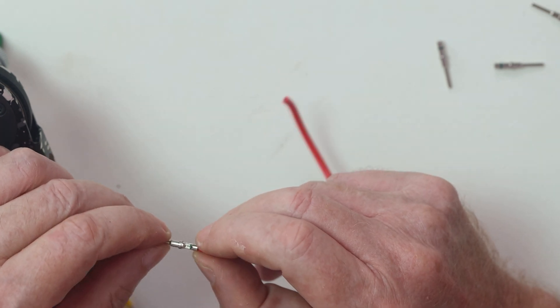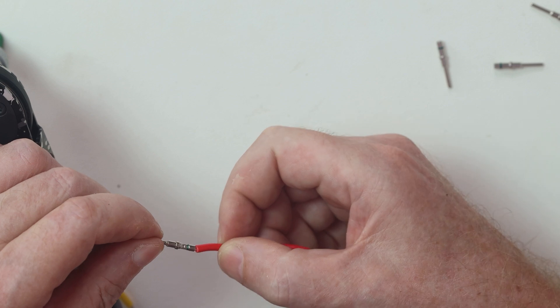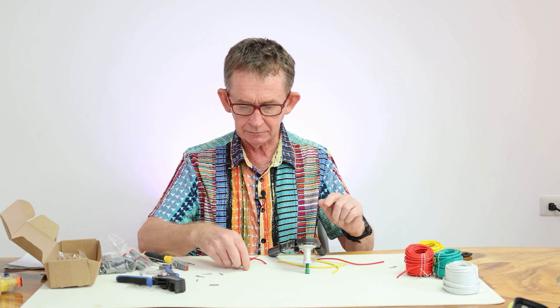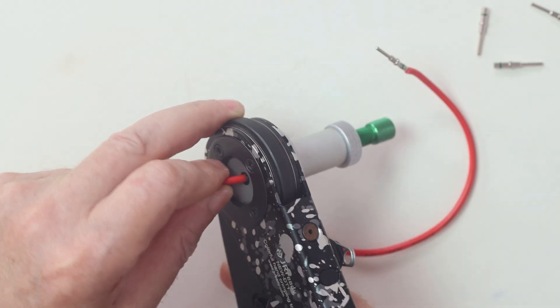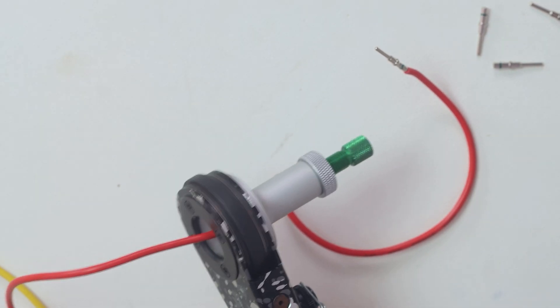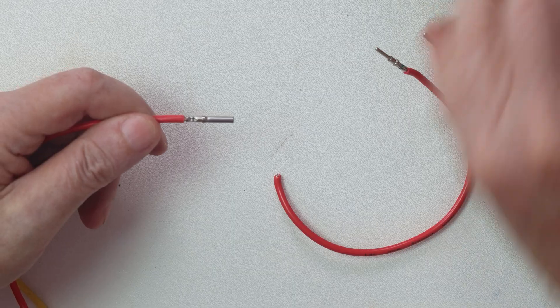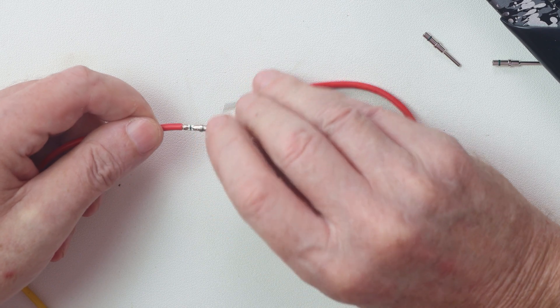You can see where it made a huge indent here and here. I may have had the wire sticking out slightly too much because I cannot see my inspection hole. So for the next one we will adjust it slightly. We push this one in and squeeze — and yes, we've gone down a bit further. I can see the inspection hole here and the wire in there.